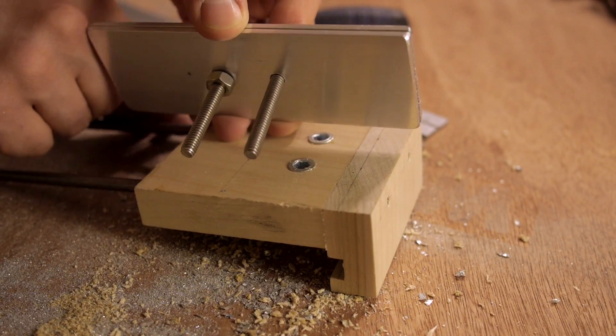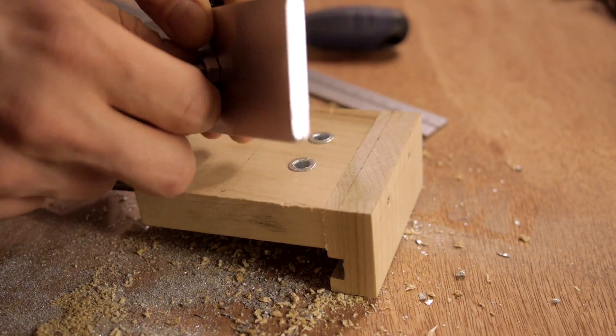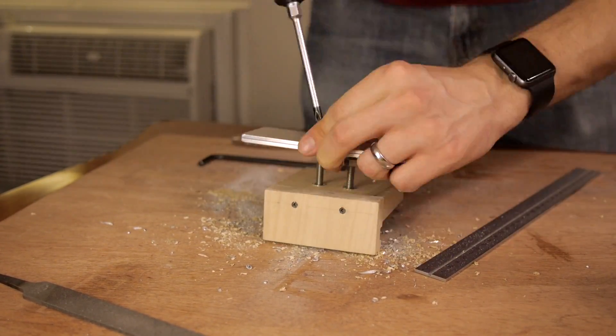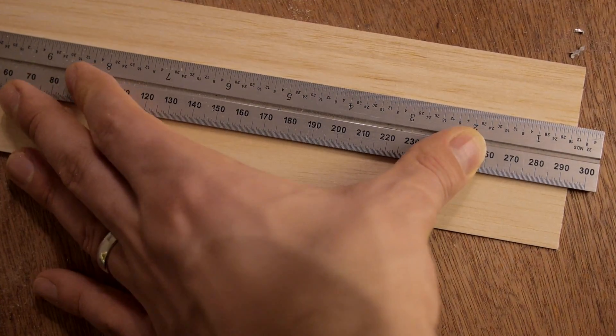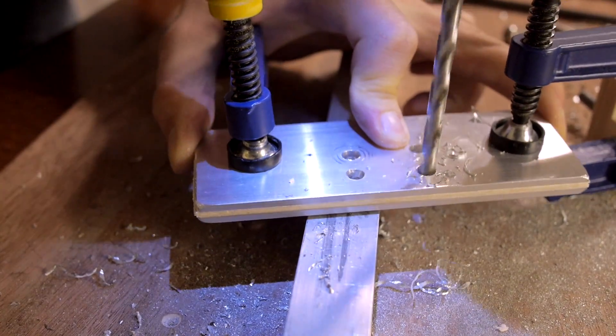There are numerous different ways of mounting the aluminum plates to the bottom of the clamp — this is just one method, pretty much the simplest I could think of. Two pieces of aluminum are not thick enough to provide a tight fit, so everything just kind of flops around. Fortunately I have some balsa and I can shim that. This was leftover from my rocket boat. The balsa is really nice to work with — you can just cut it with your knife. I ended up putting two pieces of balsa between the two pieces of aluminum before reassembling everything.